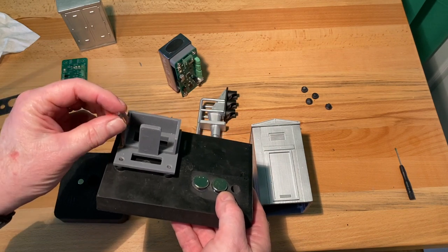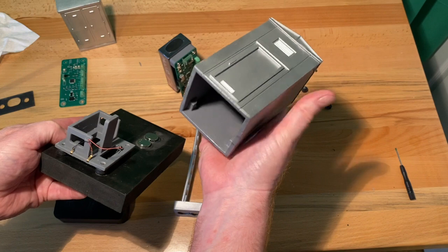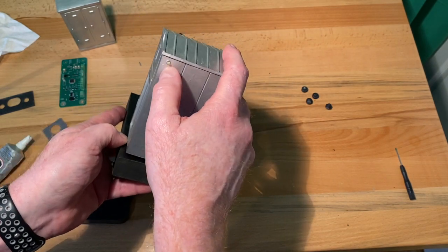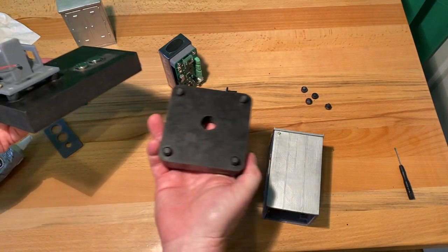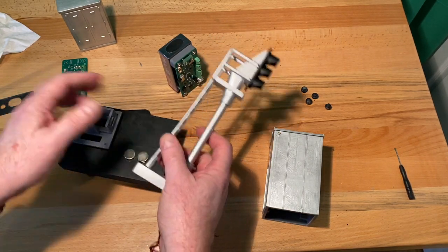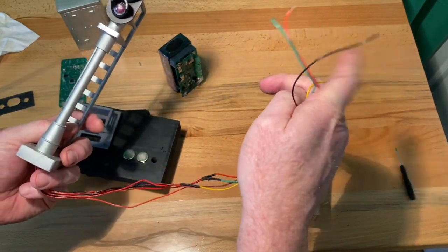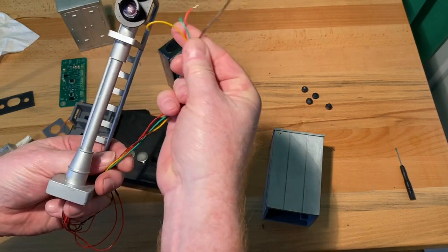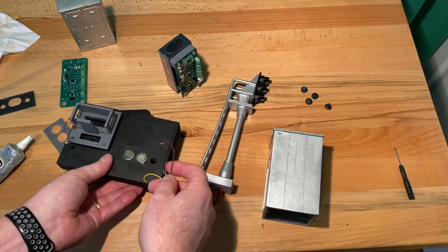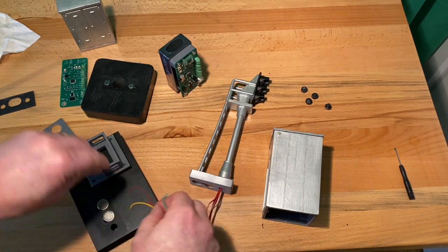You will have a little connector here and two brass tabs. The light on the outside of this building connects with copper strips, and those will connect with the copper strips to light this light right here. So there's the footing part and the magnet part. Now we have our block signal. This is one of the early prototypes where all the wires were just red and black. The version you will have has colored wires all the way from the LED — a black common, red, green, and yellow. All you do is thread this through the hole and get the wires straightened out.